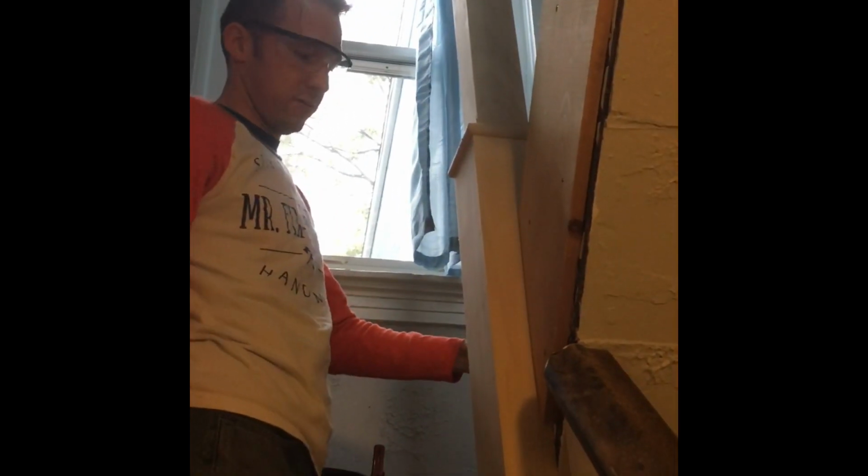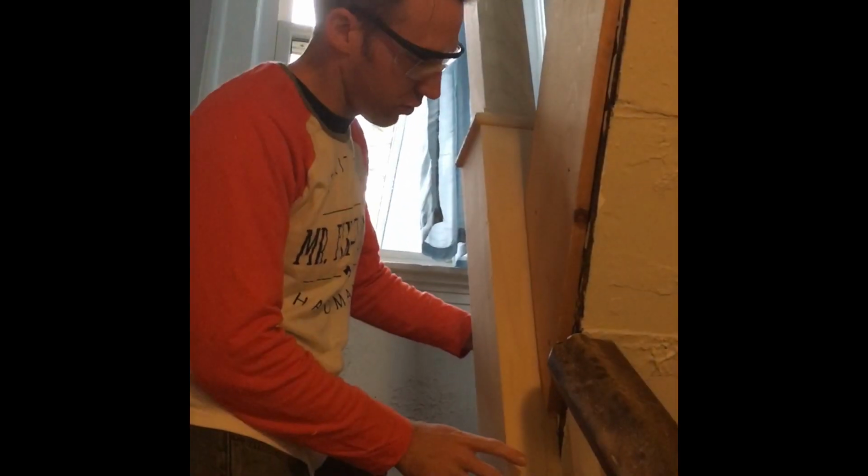That looks like a pretty decent fit, actually. So I think that this is pretty much centered on the newel. The newel is straddling the stair. Here you can see it from this side. So cut away all this part. This part sits on top of the step. It's at least good for a first cut, and kind of clean it up as need be.